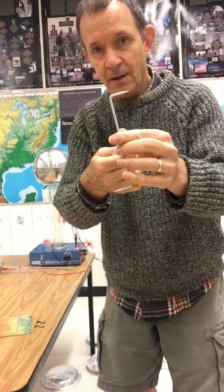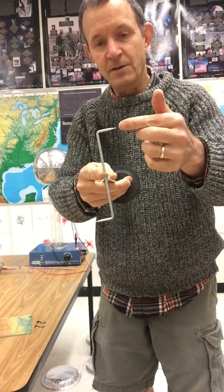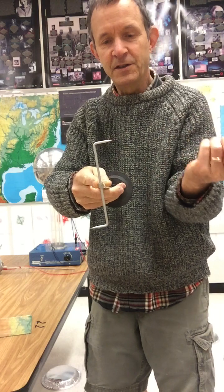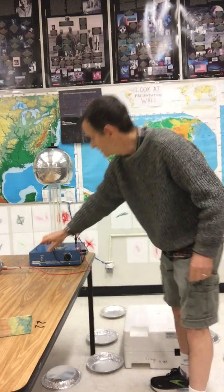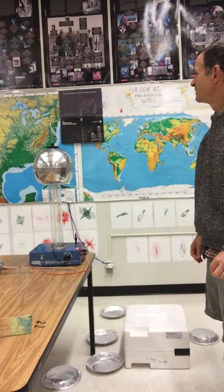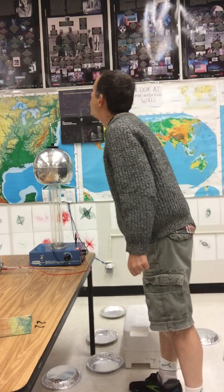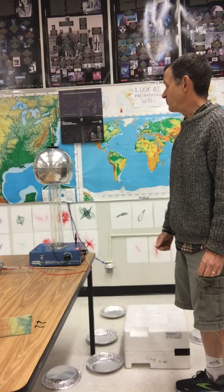This is a little vane like that, and again, the geometry of this is going to concentrate, make a very strong electric field there. Okay, and what it's going to do is it's going to spray charge off of there. Electrons will jump onto the air molecules and spray that way, right? Well, if it sprays the air this way, of course there's going to be a force acting on this the other way. Let's see if we can get this to spin. Doesn't want to spin. Here. There we go. It's sort of tilted. I needed to bend the thing there, but it'll spin pretty well like that.